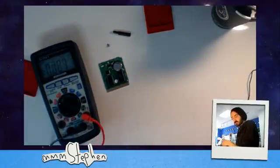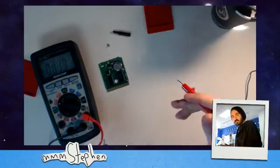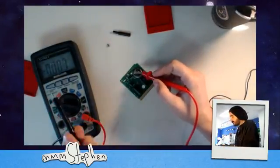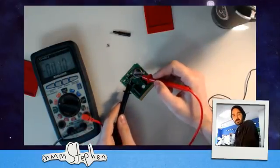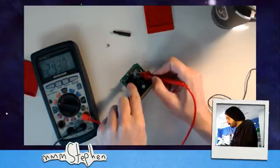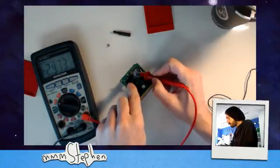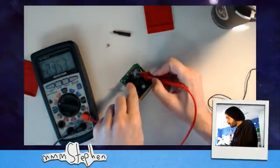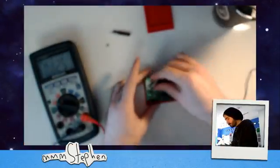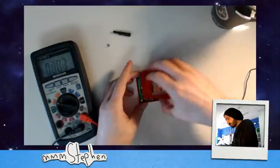So yeah, this battery tester, I bought at a garage sale for a few bucks. It was amazing. You can buy any of them if you really want, but if your game's not saving, the battery's dead. That's pretty much a fact. And this one's within range, 2.9. It's like 0.1 away from being full volt. So I'm gonna leave that because that is pretty damn good.